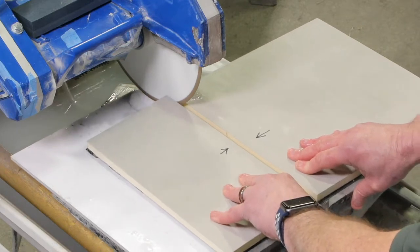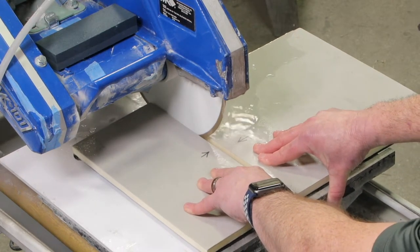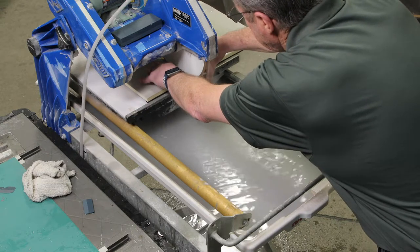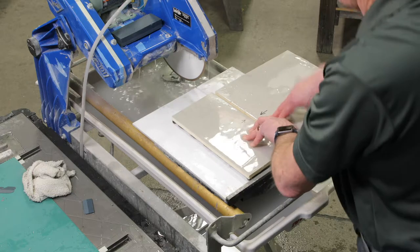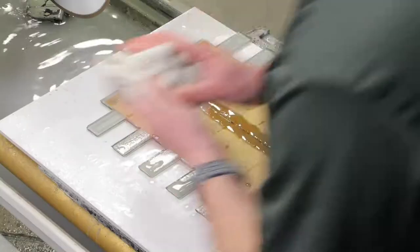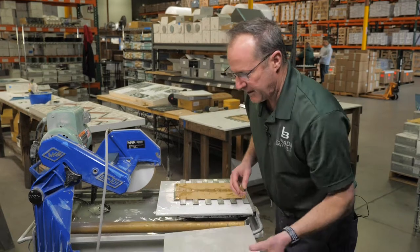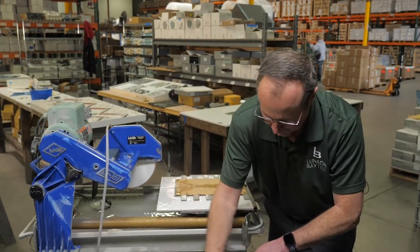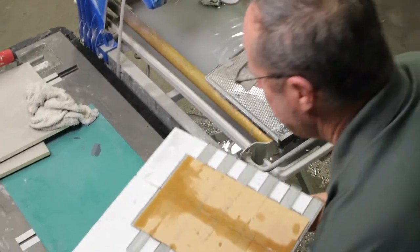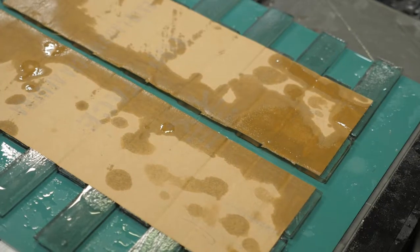Start the saw — make sure you have your safety glasses on. Turn it off, take the templates, and push it out that way. Now you can see there is a little water, but not much. I'm just going to lightly wipe it off. The key here is that you want to have a nice dry workspace. You're going to pick your base plate up — instead of picking the tile up off of the base plate, you're going to simply take the tray and slide the tile off. Wait for it to dry before setting.